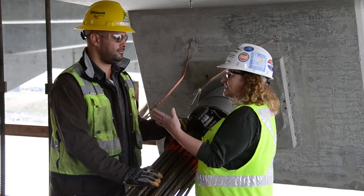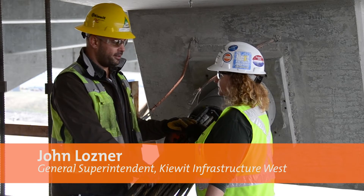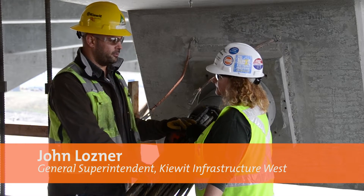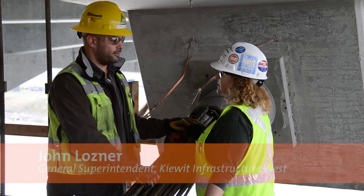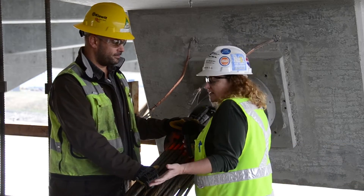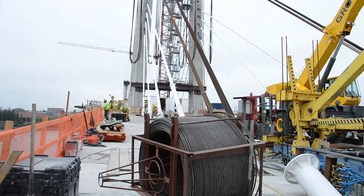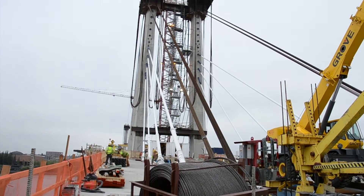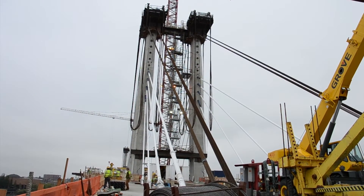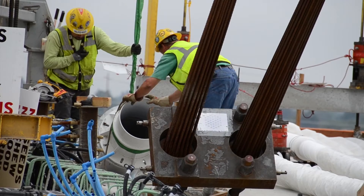So first off, tell me what stressing is. Stressing is taking a loose strand, an individual strand, and applying a load or force to it — load or weight as well it can be. And why is it important to a cable stay bridge? Without stressing the strand in a cable stay bridge, the bridge deck would probably be in the water. Strand holds the bridge deck up.